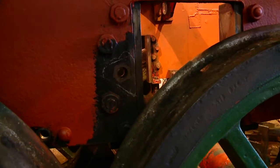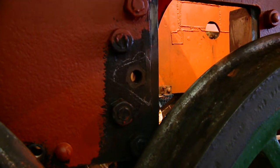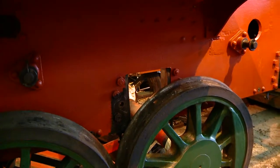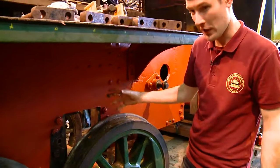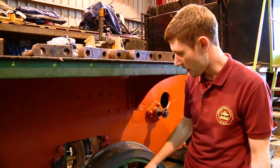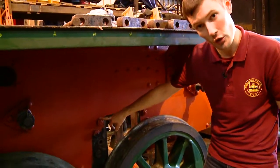These are the horn guides which guide the axle boxes that the locomotive runs in. The bolts which you can see there — unfortunately one is missing — actually secure these horn guides. Where this bolt has been fitting is a specially machined bolt that allows everything to be held fully in place. What needs to happen is the bolt needs to be replaced: it needs to be specially machined, hammered home, and a nut fitted on the outside.